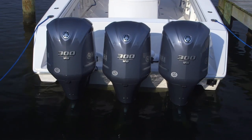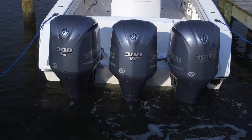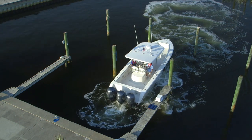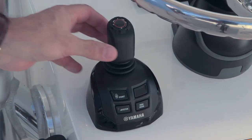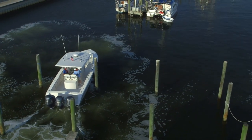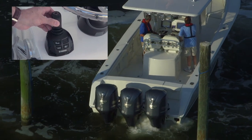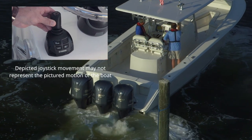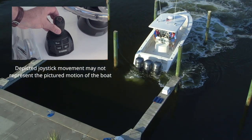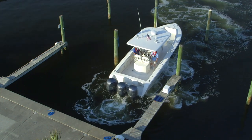To move the boat straight forward, simply press the joystick forward. Remember, the more you move the joystick, the more throttle response you'll get. You can also combine different movements to reach a desired effect. During forward operation, the boat is steered by rotating the front of the joystick toward the direction you want the bow to go. More motion of the joystick moves the bow faster and with more authority. The same principles apply in reverse — the rear of the joystick represents the rear of the boat, and the more you move the joystick, the faster the stern will move. Rotation on the boat's axis is done by simply rotating the joystick in the direction you want the boat to spin — the more you move the stick, the more engine power is exerted and the faster the boat spins.